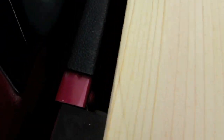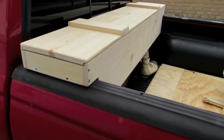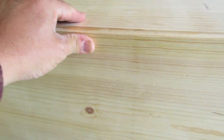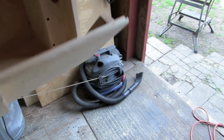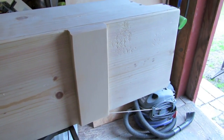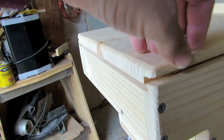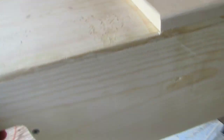I've got to cut out a little bit down here to allow for this box, then I'm going to screw it down. I could already tell I was going to have trouble with warping — that thing was trying to cup on me already. So I put a cleat on there to hold the top level and flat, along with two on top — that ought to do the trick. Those cleats will keep the end straighter and also help seal it when it drops down inside, which helps weatherproof it a little bit. I've got a little warp in it but that's okay.